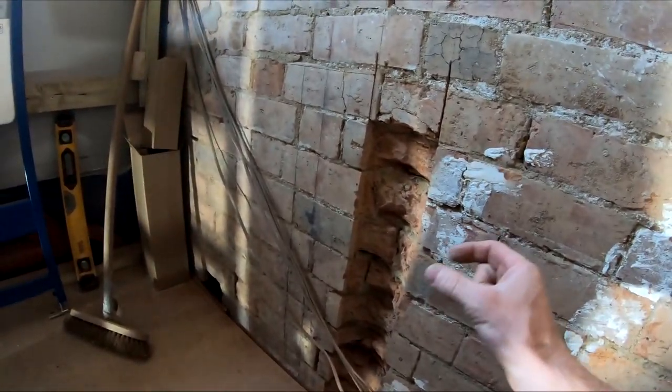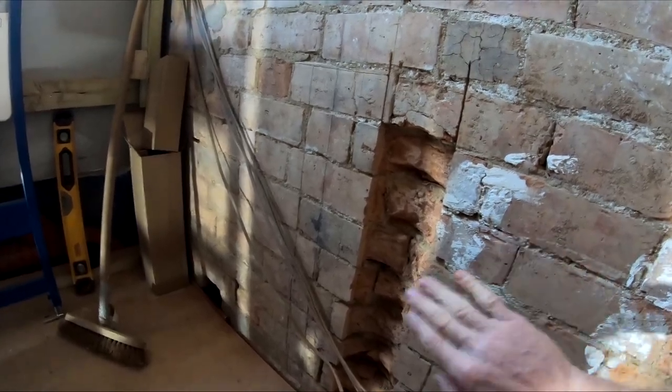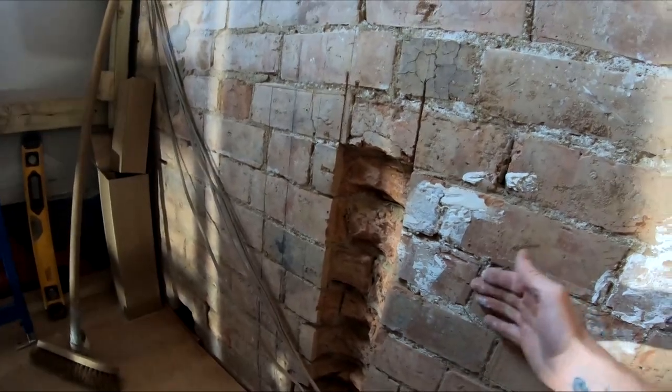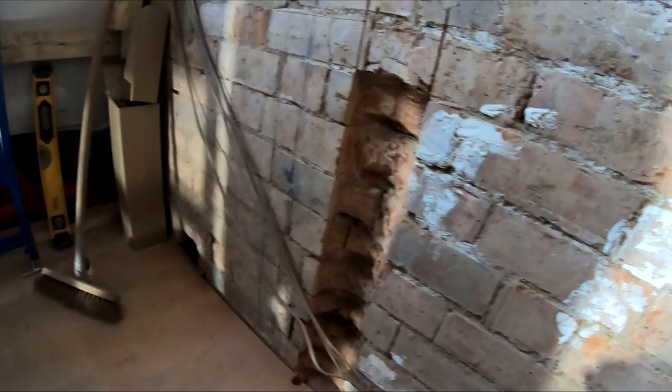That just gives us a few extra centimetres of movement in here so we can get the board tighter back to the wall. If we'd have just planted them straight on, by the time the board's on, it'd be at least 2 inches off the wall, so you're gonna lose that from the width of this room. So it's really important that we've done that there just to give the client a bit extra space in the room.